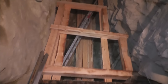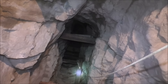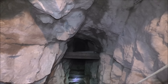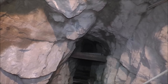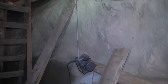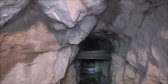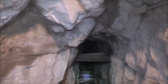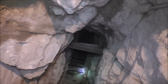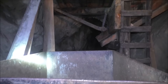So we're continuing our mine rehab project. One of the things we had to do is remove these old stalls. We'd go up with the ropes and the chainsaw and cut those old timbers in half, but it was actually tough to get them down because they're bound in there. We found out an easier way — instead of monkeying around with a chainsaw on a rope, just hook the winch up with a pulley and lift the stalls up. Each stall has a little pocket in the rocks, so if you just lift it up a little bit, you can get it out and then drop it down with the winch. We've actually lifted the stall up, got it out, and we're going to drop it right into the ore car.